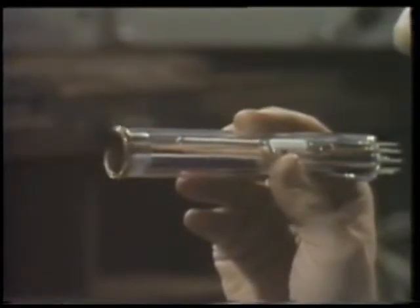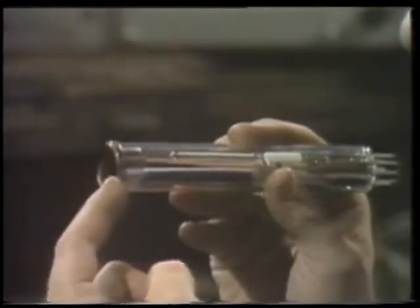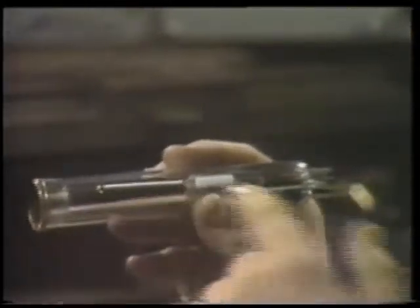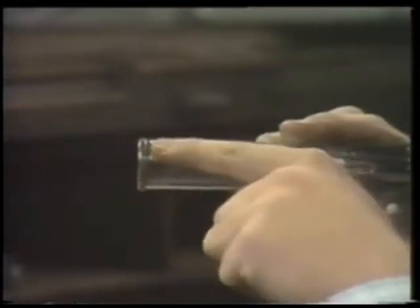That spot falls on a light-sensitive layer in the tube at the front called the target. The picture is focused on the target by an ordinary lens. There's actually a little picture focused there just as it would be on film. And the beam contacts it from the other side. Now, because of its chemical properties, wherever light falls on the target, electrons from the target leave.